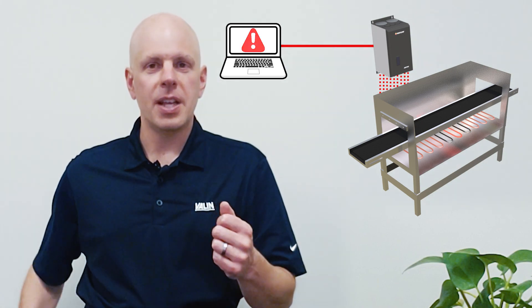In addition, remember in our previous example, unless that sensor was located in just the right spot it couldn't even tell if the heating element had failed — you would need two or three elements to fail before the sensor would figure it out, send a signal to the temperature controller, and the temperature controller would in turn tell the power controller to work a little bit harder. Because the Aspire is on the power side of the equation, it senses immediately when one of those elements fails and is able to take action. It reroutes the remaining power to the other elements, ensuring a consistent, even heating profile in your oven.